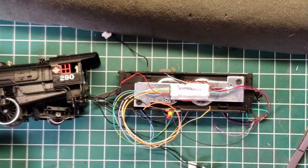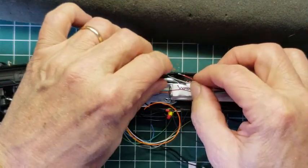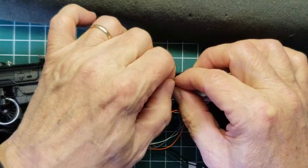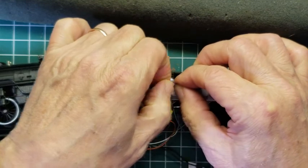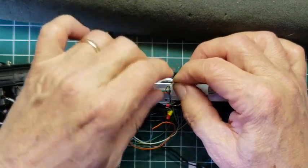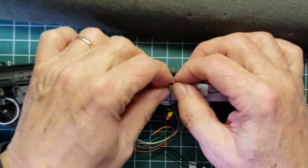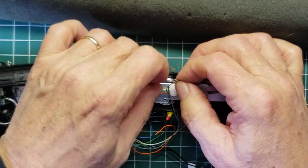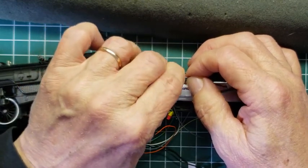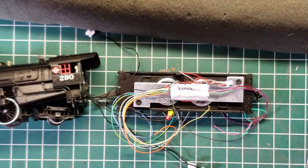And if you're an amateur, which many of you are, and you're just learning how to solder, a good thing to learn is to tin. That tells you a little bit about whether or not the material that you're soldering to is clean, whether or not it's overly oxidized. People start using wire that doesn't solder well. A good candidate for that is things like aluminum, stainless steel, anything other than copper. So many of the wires that we use today are copper.